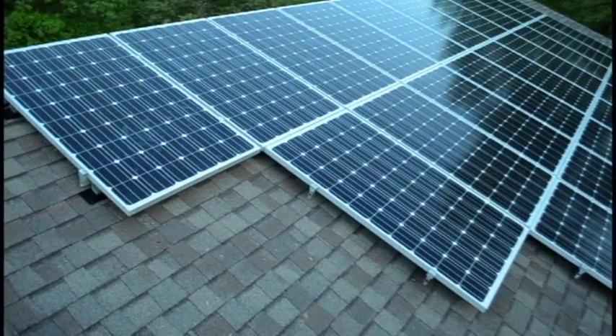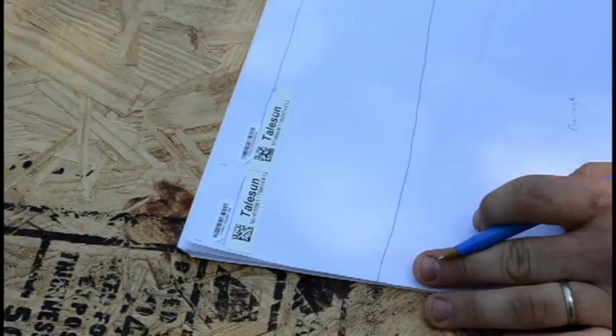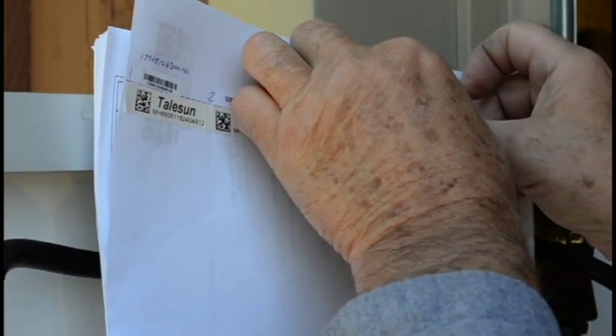When all the modules are down and cabled together, you'll need an electrician to connect them to a new power management system. Be sure you square everything while you're installing the modules. While it's not technically required, we recommend you create your own panel record while you're installing the modules. Suppose a single panel failed — your power manager will inform you which panel is faulty, but not necessarily where the panel is located on your roof. A panel record will solve this problem. Simply remove one of the sticker serial numbers on the ACPV module when you connect it to the rails. Each module has two stickers, so don't worry about losing track. Take the second sticker, place it on a grid, and if you ever have a problem, you'll know exactly where the panel is located in your array.